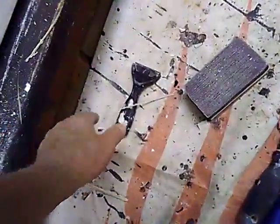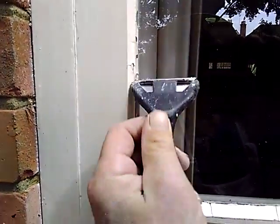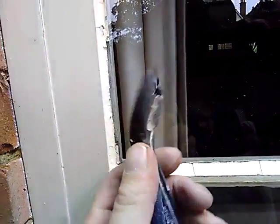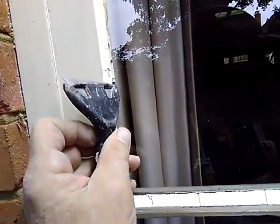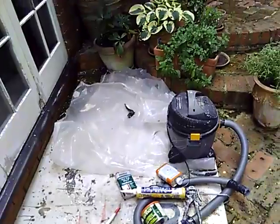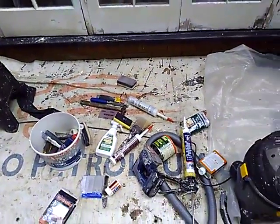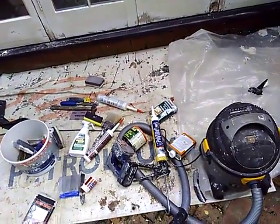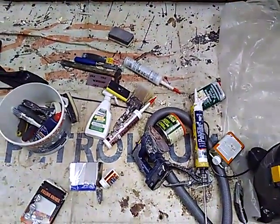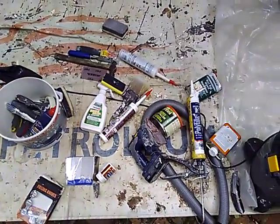The other tool I use a lot is this one — anywhere you see flaking paint it's got to come off. It's hard to do with my left hand but it's a good tool, you can get in there all over the place. The vacuum is really handy too. I'll be using the Dulux undercoat and Dulux topcoat Weather Shield. I think that's it for now — any questions, comments, or suggestions. Thanks for watching on this nice August 25th, 2016 day.